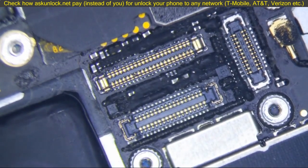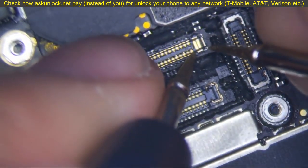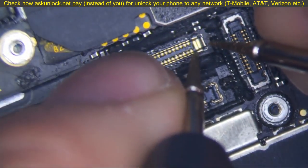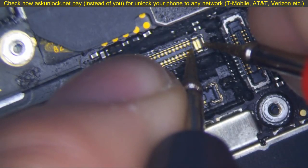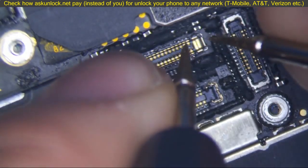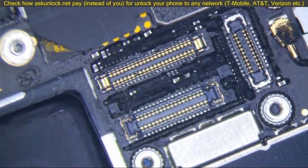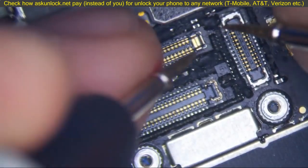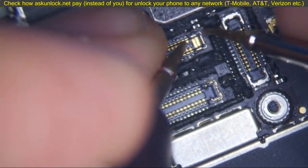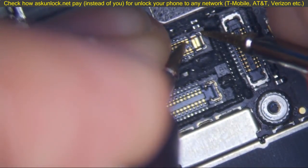So I'm going to push the power button now. Actually, let me measure this voltage as well. Careful not to short it. 0.13 volts. So the big voltage is that one, about 4 volts. Okay. So I'm gonna push the power button, turn the screen off. There you go. I heard it. So the screen's off now. Can't see it, but so this is still 3.8 volts.